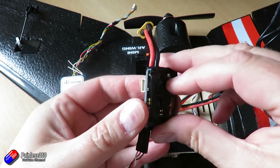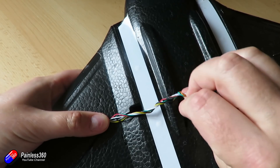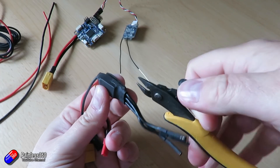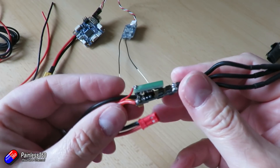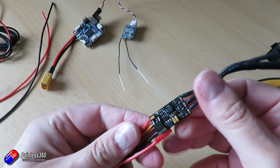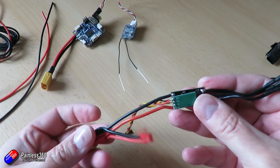The wiring we need to think about is all covered in the ArduPilot wiki - there's a fantastic wiring diagram showing how everything connects together, so all I'm doing is following that. I need to make sure the battery is coming onto the battery pin and that the ESC is connected to the output. The Sonic models include a little JST plug to power the video transmitter, and since this wing already has a video transmitter and camera, we'll change the wiring so it works with the ArduPilot on-screen display too.